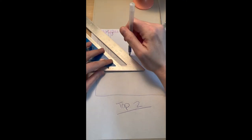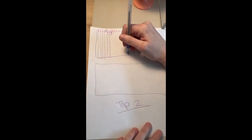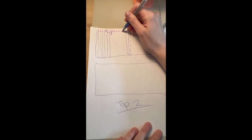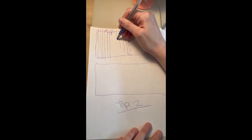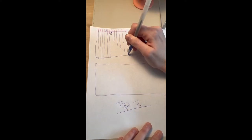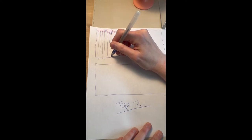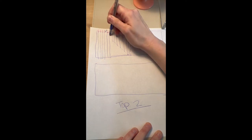I was really hoping for seven but seven just went too much into that pattern and didn't line up. So you kind of just go down with each of those vertical lines all the way to your 45 — and that's also going to be your 45 cut. I'll show you later in the video how I do this with no math, and then you come back across up until that line using that gap, so it kind of flows into it but you have a little bit of spacing in between.